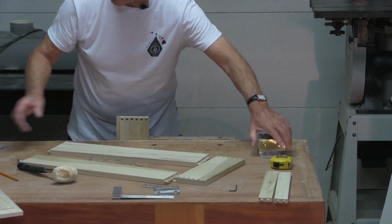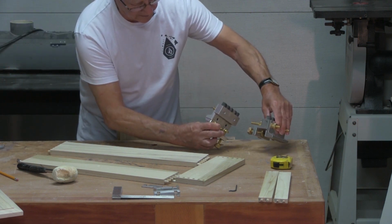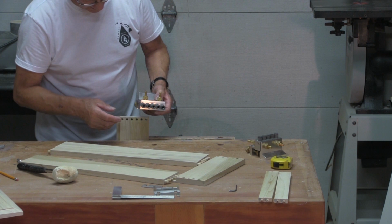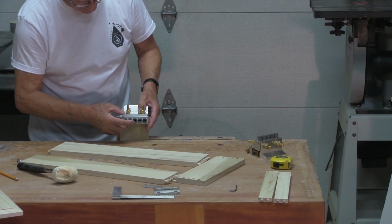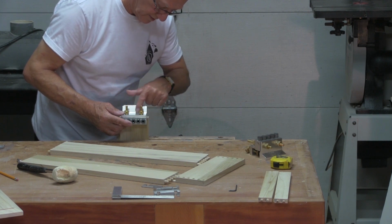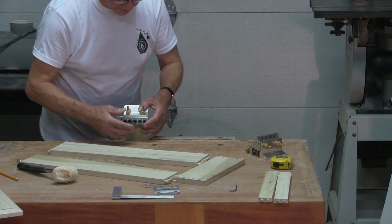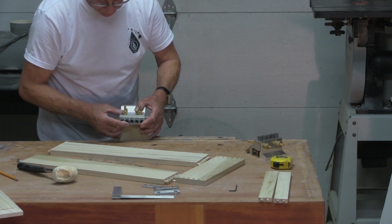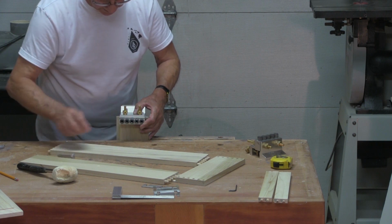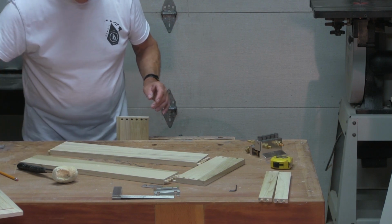And then what you have then is Dowelmax in this configuration, which is really different than that. And then you just use exactly the same spacers you used for this one, and you use exactly the same reference marks, and just make sure you reference the block. Some people reference this bracket here. That's wrong. You always reference the block, this here, and then you just drill 1, 2, 3, 4, and 5. Move it along with the indexing pin, put it in there, and then drill number 5 again, and that'll give you the 6 holes. And this works very well.